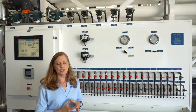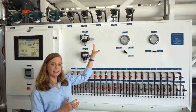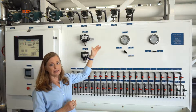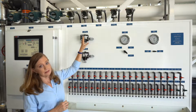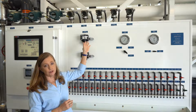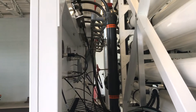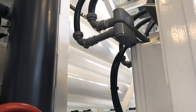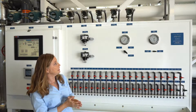It's important that the instrumentation not trap air. So we like to have all the instrumentation on the skid installed up high, and the transmitters are also high so it's fairly easy to bleed the air off of them. The transmitters can be so high that it becomes difficult to read them, so we have on the back side a sample panel aluminum support frame that's custom made in our shop to angle the transmitters down so you can read them.